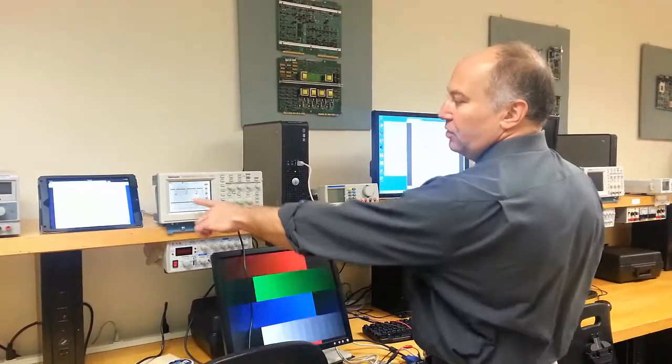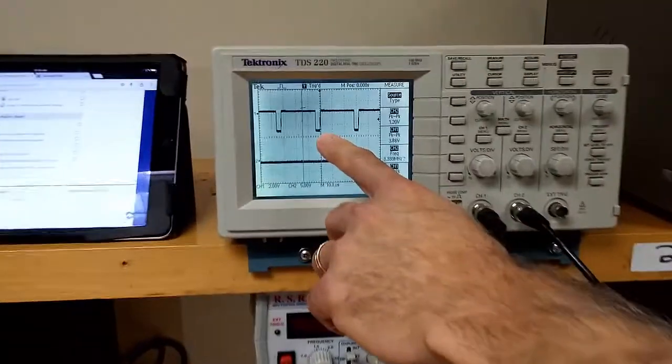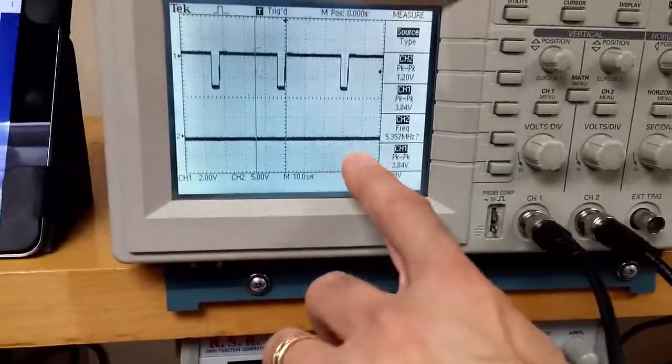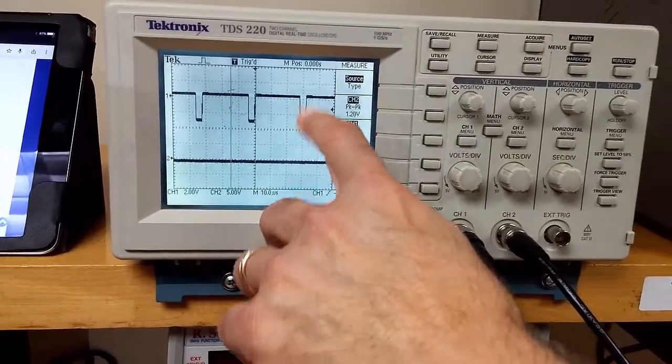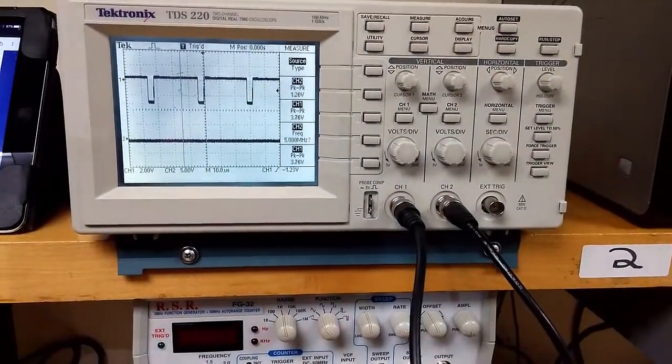Work that you guys have done up in the lab. So this first signal here, if you can zoom in on this, is the vertical sync pulse. So you can see with the 10 microsecond spacing for each graph, the vertical sync comes 10, 20, 30, a little bit more than 30 microseconds. Every 30 microseconds, we do a vertical sweep.